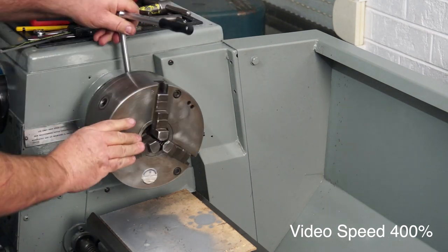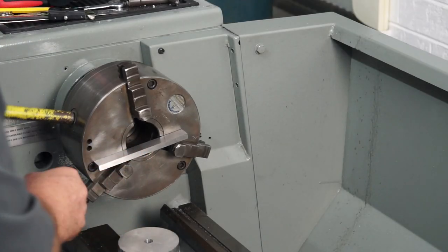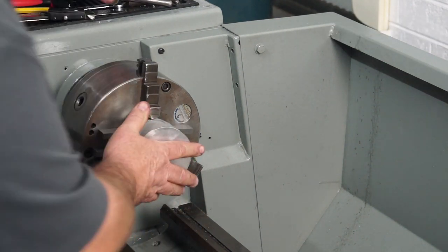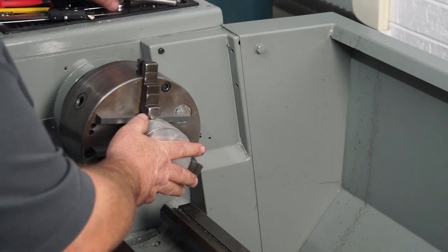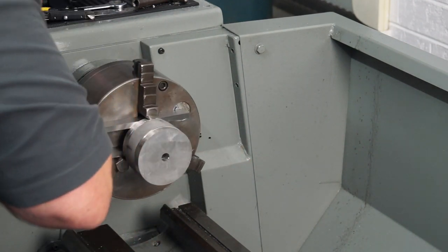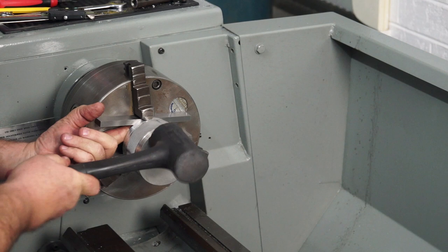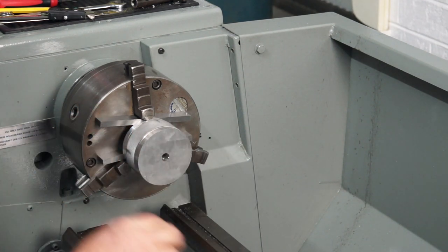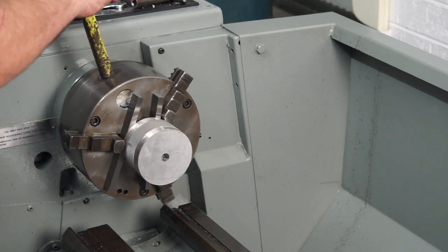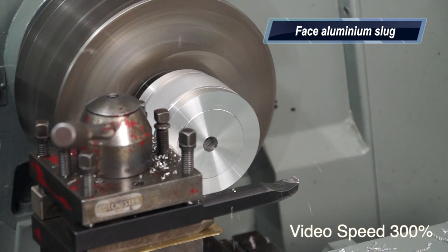This is a really good quality three-jaw chuck — I believe it's a proper high-speed chuck suited for that Colchester lathe. The Colchester's got a high RPM spindle, capable of 2,500 RPM. I'm using a couple of parallel strips borrowed from my milling machine, just offsetting that aluminium slug I'm popping into the three-jaw chuck. I'll give it a tap with a dead blow hammer to make sure it's up tight against the face, then check the chuck in three spots. Always remember to remove your parallels — they will fly out and kill you.